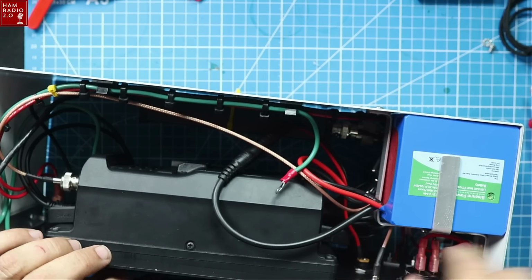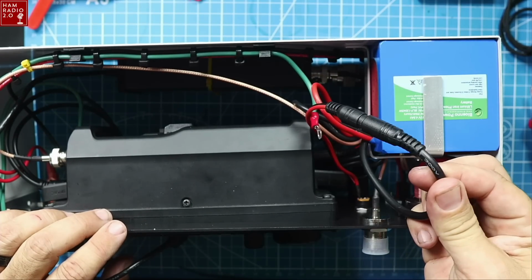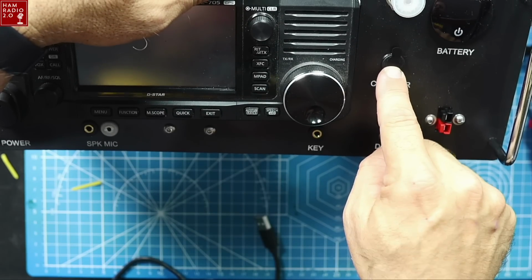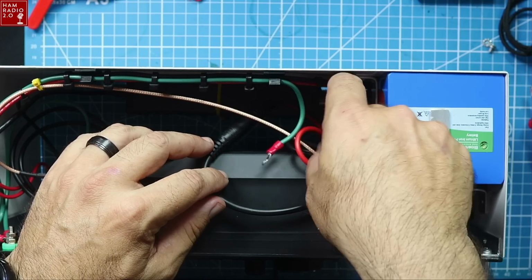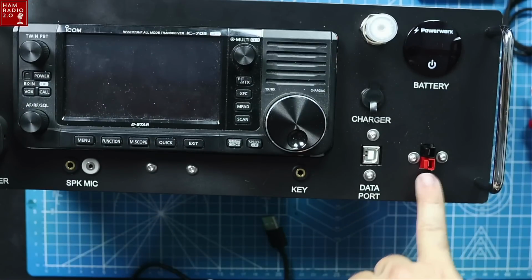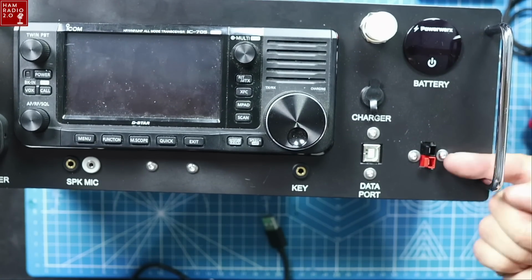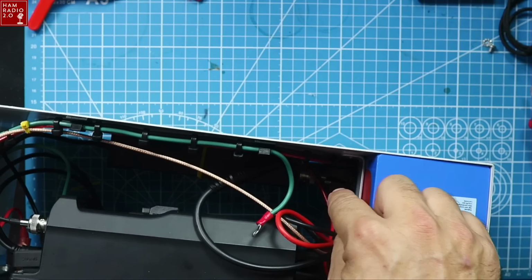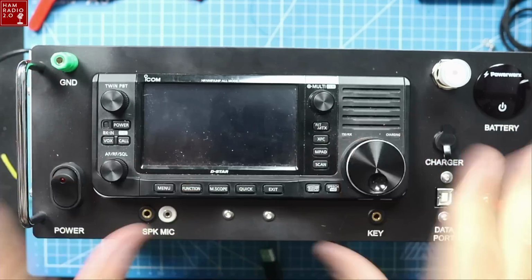I also went ahead and put the battery in. We connected the barrel connector coming out of the Bioenno, which goes to this port right here. So you use your standard Bioenno charger just to plug in there. And then we connected the internal connection of the power poles was correct. He mounted this one backwards, like I said, red on right if you're looking down from the top, which is this way. But this one was correct. So the Bioenno plugged in there, red to red, black to black, like it normally should. No problem there. So now we've got everything that we need.